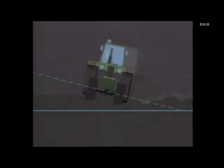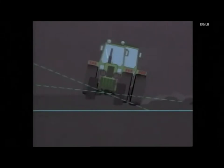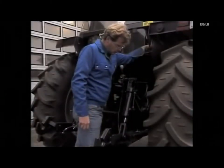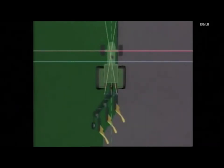As the plough and tractor are coupled by the three-point linkage, if the tractor's lift arms are not the same length, the plough will lean into or away from its work. The simplest way of checking that the lift arms are level is to measure the distance between the upper and lower pins before coupling the plough. To ensure that the plough follows the tractor correctly, it is important to check that the cross shaft is at the right length. The extension of the lower link arms should cross the centre line of the tractor, just behind the front axle.